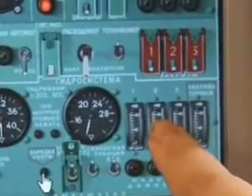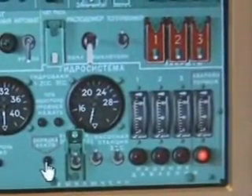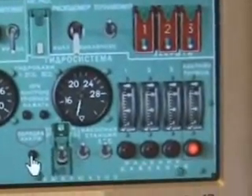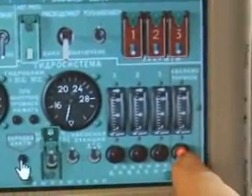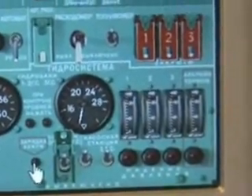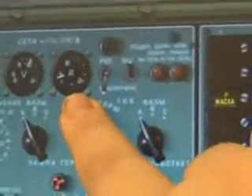The emergency brake system is charged by these two systems, which pump hydraulic pressure across to the braking system. As you press them, they will come down and meet about there. If you hold that down, it won't actually continue to rise, so you need to relieve the pressure on the braking systems. Once that is done, you can continue with the second press of the button and the lights will go out. Check that these are all stable and turn the system back off. The auxiliary power unit loading has dropped back to four.